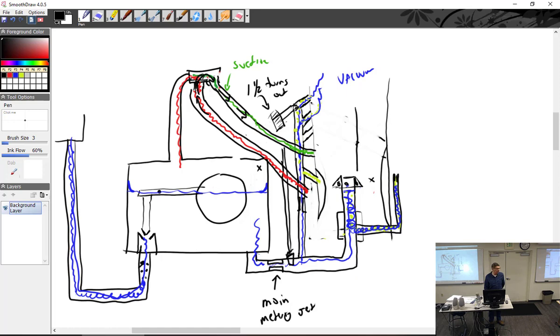And then what happens to the carburetor? It'll quit. Because if we equalize the pressure over here to the pressure over here, then the carburetor no longer has fuel flowing, and it dies. That would be pulling the mixture all the way. Yeah. And it'll kill it.